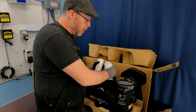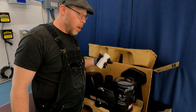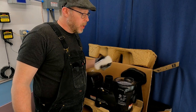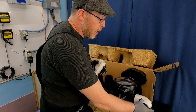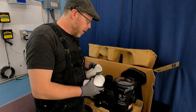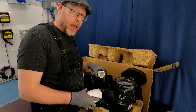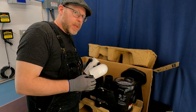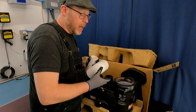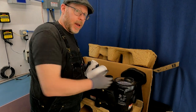You wouldn't want to use a 90-degree fitting — that's just what I had on hand. You would commonly use a coupling or something like that, and especially on the front the same thing: use a coupling so that you can adapt your two and a half inch pipe, and you want to have about five times the diameter of the pipe in a straight run in front of the suction inlet.